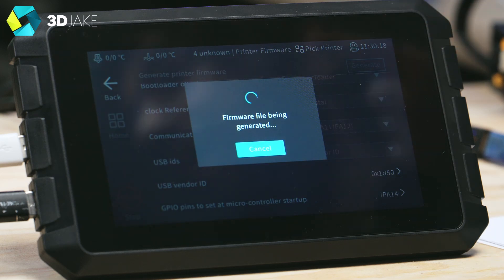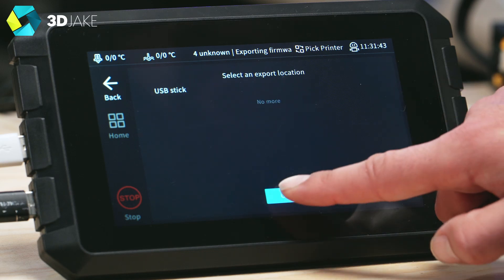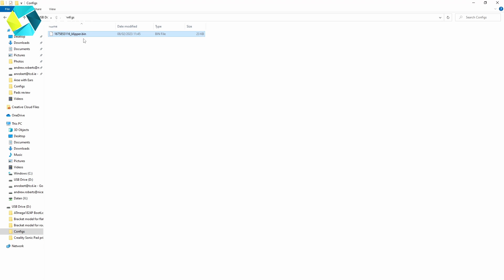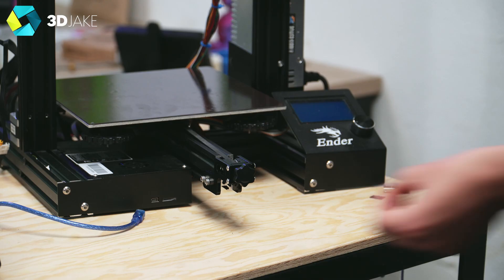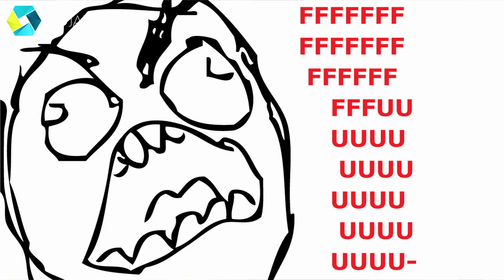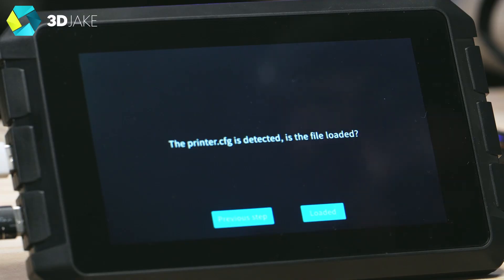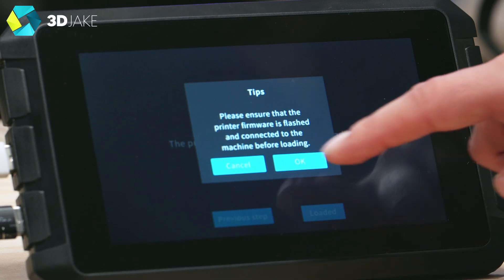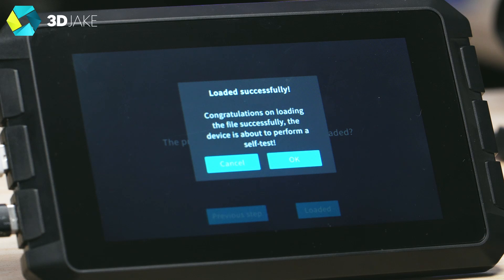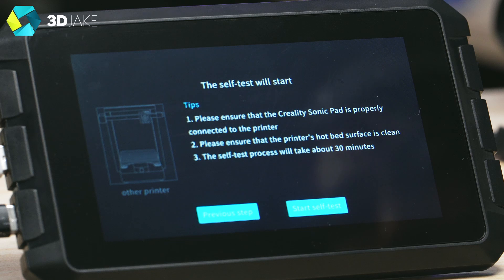Click 'Generate' and ready the file for export to the USB — it should say it is generated. Press OK and it will export to the USB. Rename the file to firmware.bin, put the SD card in the 3D printer while it's off, turn it on, and it should boot. Depending on the printer or board, the screen will go blank and stay blank, or show the splash screen after about 10 to 15 seconds. Go back to the printer cfg screen, make sure the printer.cfg file is on the USB, and click Next — it should say it is detected and the file was loaded.